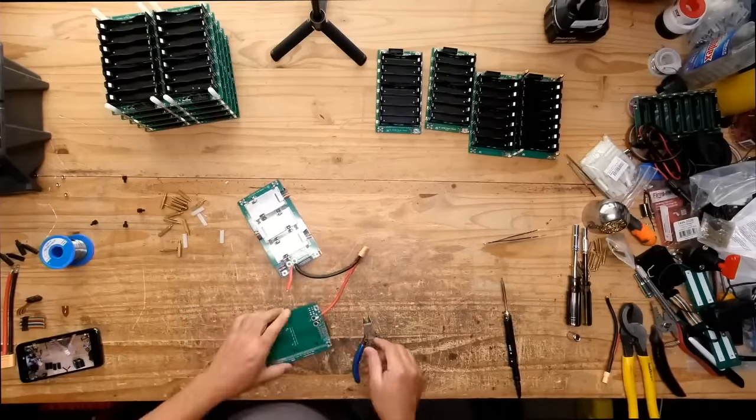So I forgot to include the little link for the actual connector. The connector that I ended up using was one that I had laying around, and it's not available. I couldn't find it, but I found another one that's equally as good. Maybe it's gonna be harder because you always want the round connectors or the round panel mount adapter connectors, because then you can just use the drill bit to make a round hole. Anything that's square, then you have to use a saw or something, which just adds complexity to it. But